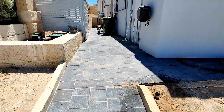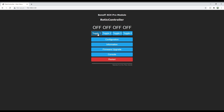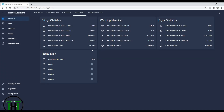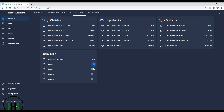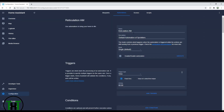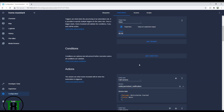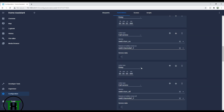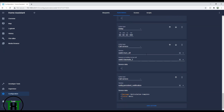Now for what makes this an automated system. By flashing the controller with Tasmota I can open a web page that gives me control of the relays. But for scheduling, I've added the controller into Home Assistant, which is free home automation software. You can see the Wi-Fi signal quality and other info, and turn the relays on and off. Here's an example automation script: it's activated at 6am every morning, but you can add conditions — like it must be a certain day, or if it's going to rain, skip watering. I just turn the master on, then the stations in sequence for whatever interval I choose, then turn them all off. I've also added notifications for when the sequence starts or stops.